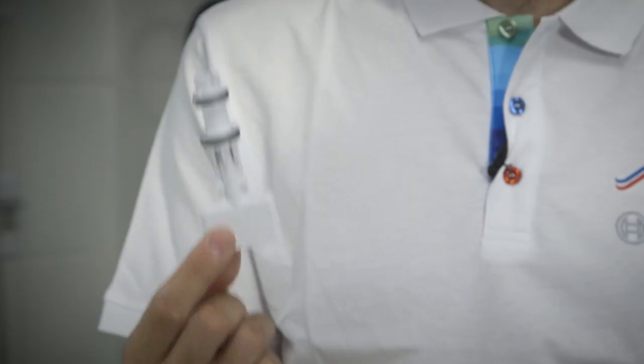So that's how we operate an external filling loop. However, you may have a boiler that's got an internal filling loop. Now in order to repressurize the boiler, you will likely be provided with something like this. This is a white key for a keyed filling loop, and I'll show you how to use it.